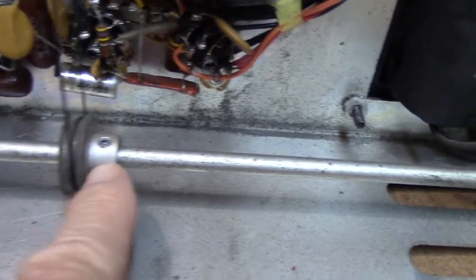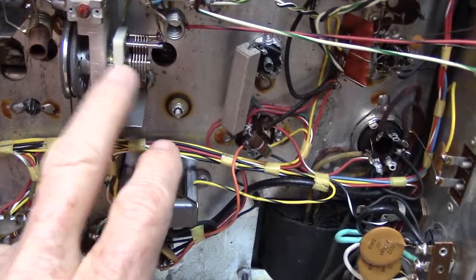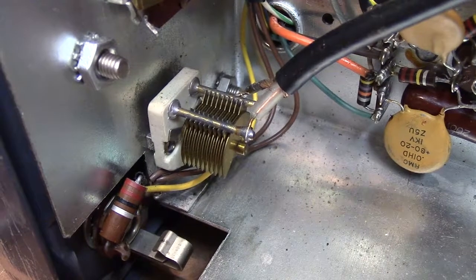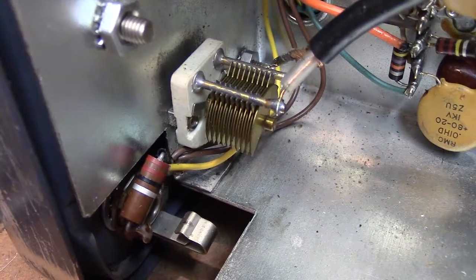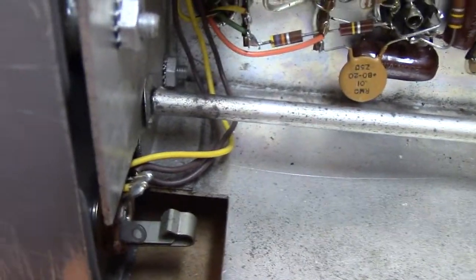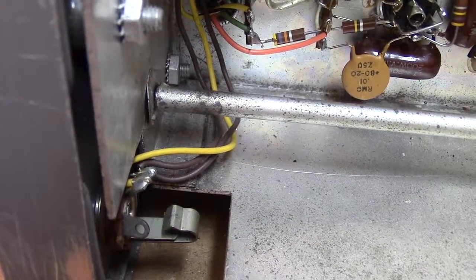When you're done you've taken the shaft down and pulled the capacitor off. You might think: I'll mount that capacitor down here on the front panel just like the A model. You can do that — you have to pull the front panel off, take all the knobs off, and drill two holes to mount the trimmer. But you're going to find it won't work because this trimmer has a short shaft — it's not going to go all the way through the panel — so you can't put the knob back on it. I have a solution for that.